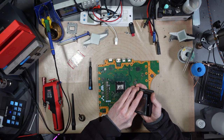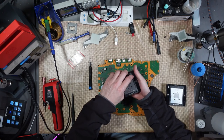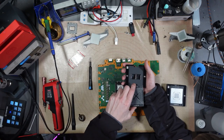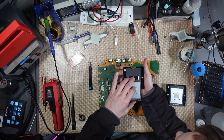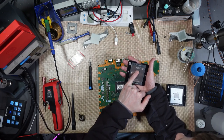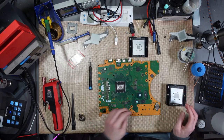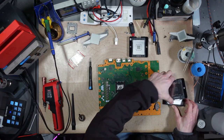There's my magnetic stencil for the Southbridge. You take it all apart — you've got a magnetic base with a neodymium magnet. You put your chip on, then you place your plate over the top and slide it on. It sandwiches the chip between the base plate and the top plate, and it allows you to do a perfect re-ball every single time using solder paste. No more re-balling Southbridges by hand.